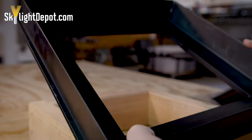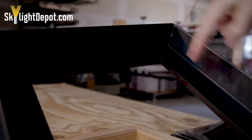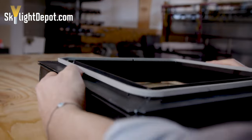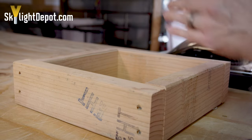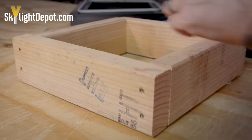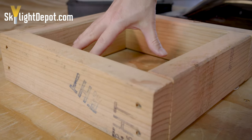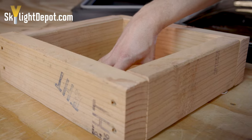When we flip the skylight upside down, we have what we call the mounting flange, or max skylight frame dimension, which is from one side to the other and from this side to this side — that caps over the curb. The mounting flange has to be bigger than the box you're capping over. The inside curb dimension is what we call the rough opening, which is the opening of the box, identical to the hole that gets cut in the roof.